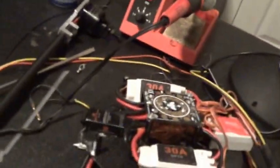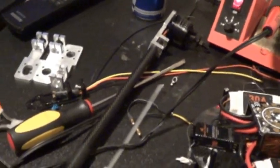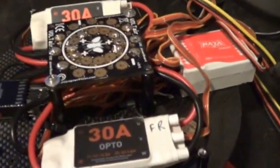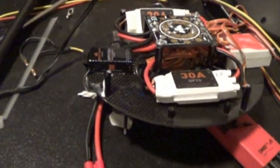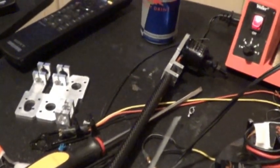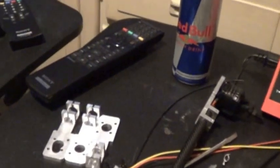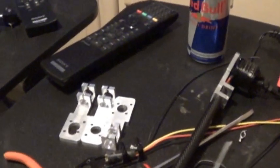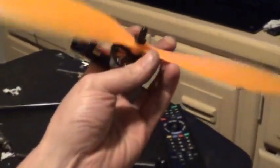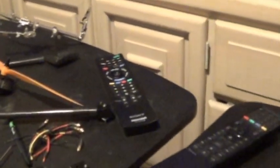What is going on YouTube? Today's video is on quadcopters - my T580P Plus that I was selling. I have it apart because I wasn't happy about the motors or the propellers. They were out of balance - some would start up, some wouldn't. If I hit the throttle it wouldn't spin right away. And the propellers that come on the T580P Plus are so out of balance - you can see cracking - it's horrible and you just get so much vibration.